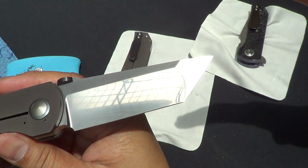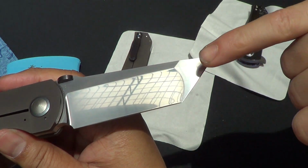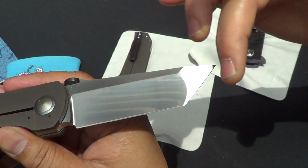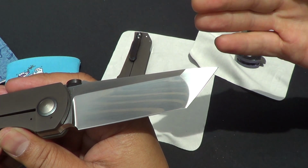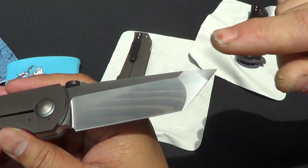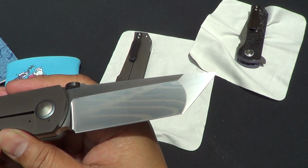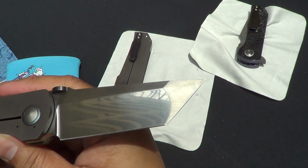Because let's say you just go ahead and grind the whole blade, tip on there, grind lines everywhere, and you start rubbing all this area back and forth. Well, unless your sanding block is the perfect radius to fit the radius you've ground this bevel to, you're going to wash this line out. I've seen it on many, many knives where it might have been beautiful at one point, but once the maker started hand rubbing it, this line just diminished. So the steps that I take are to preserve this line. I didn't even consider that line. That's crazy. That's what makes it. Look how much work, how much time invested in it. You definitely did that.